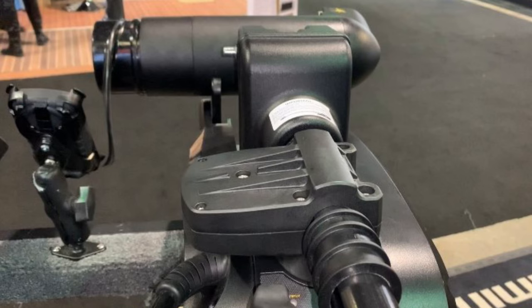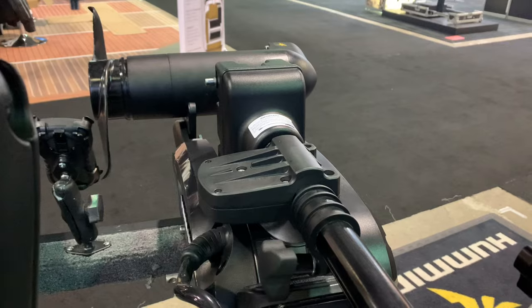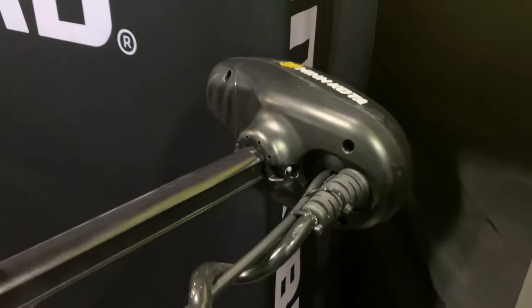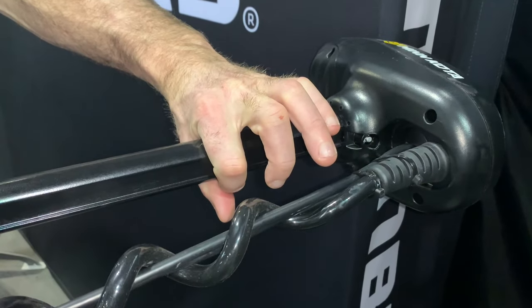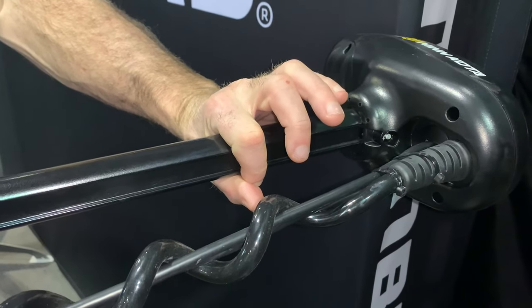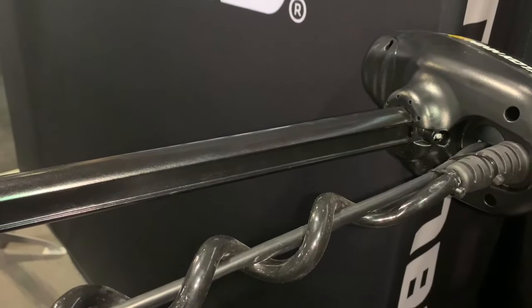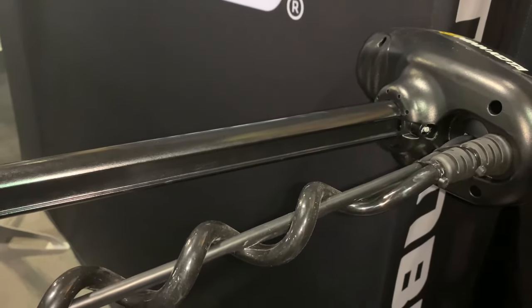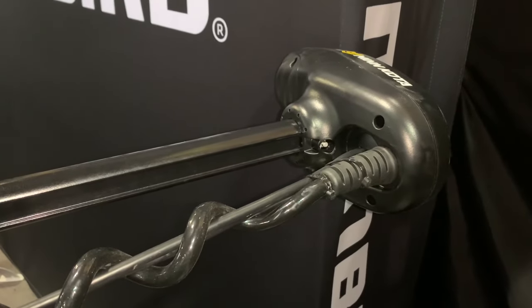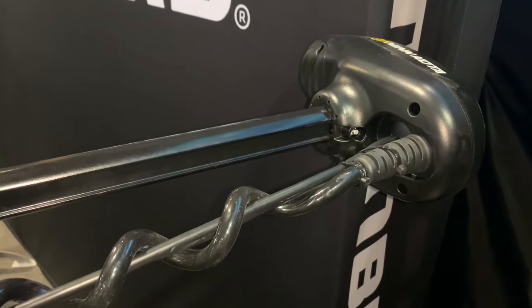Here's another angle showing the depth collar adjustment as far down the shaft as possible. We have a long 60-inch shaft trolling motor here and this head is going to bounce around quite a bit. What some people will do is put a RAM mount here, with the ball permanently attached to the trolling motor going down to a fixed RAM mount on the side — or you could use a strap — and that will eliminate the bouncing and serve as another safety against the motor accidentally deploying.